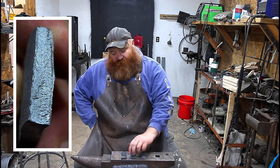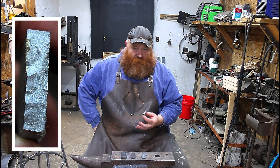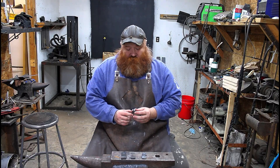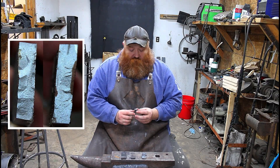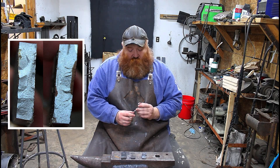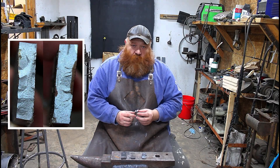When we take a look at the initial snap test and we look at the water here — I mean, it shattered. It absolutely shattered. But the grain structure isn't that bad. Now, if you take a look at the pre-temper versus the post-temper, not a lot has changed. It's a little bit tighter. You can definitely see where it absolutely shattered, where the cracks were, because that heat treatment — the tempering colors got in there and started bleeding in everywhere. So yeah, it was pretty hard, pretty well shattered.